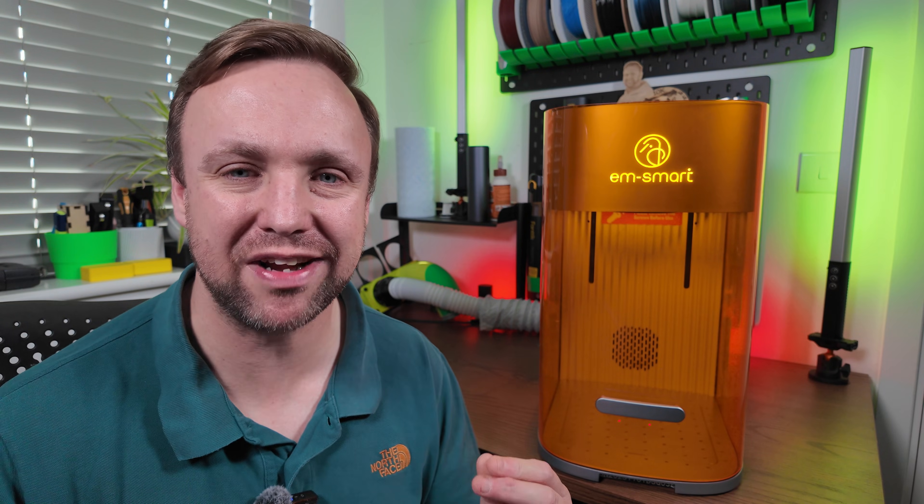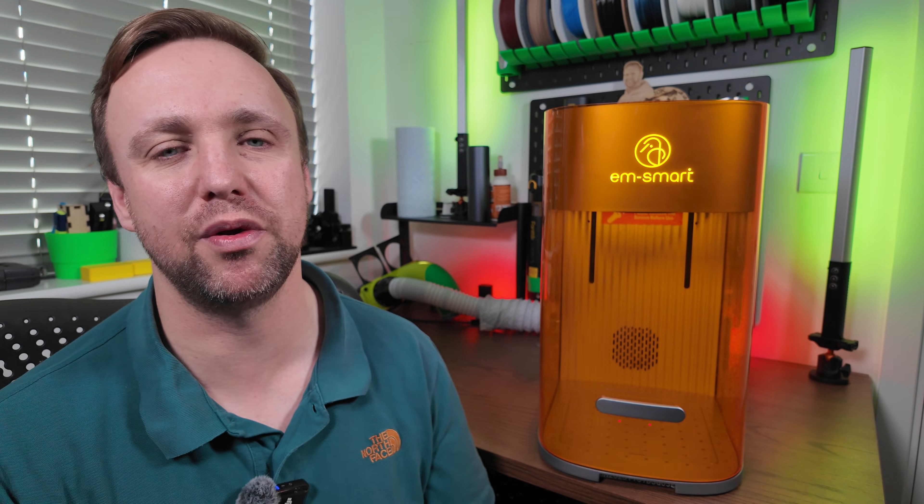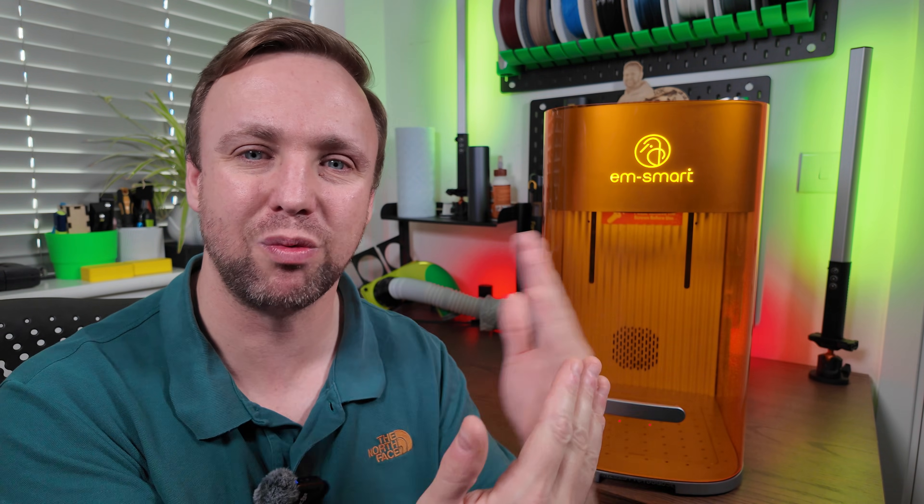My first pro is the two-in-one capability. I really love Galvo lasers, and the ones with two-in-one capability are absolutely perfect. It's great for anyone getting into lasers because you don't need two separate machines on your desk. You can switch seamlessly between diode and fibre capabilities — going from wood to metal to plastic in the same session is really easy. I found the 20 watt was more than enough to handle everything. I got nice contrasting colours on metals, did 3D printed material with a nice white contrast, and really burned the wood to a crisp engraving.